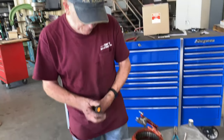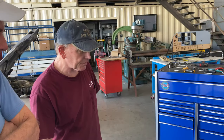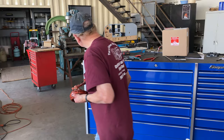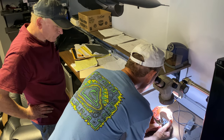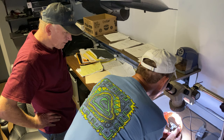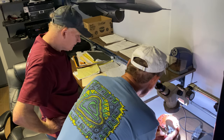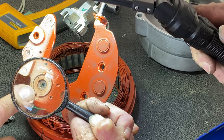All we'd have to do if we wanted to, we'd just put this thing back together, re-solder the diodes and run it. I'm going to go up and look at it under the microscope just to make sure that there's high resistance there and verify that thing is bad. It's all dark like it was arcing. Holy crap — it was a bad solder joint, so then it started melting, and that's what was making all that noise. I'm looking at the other solder joints — they're all good. The resistance went up and it melted the solder, and that was the problem.